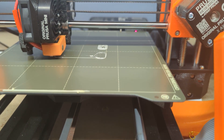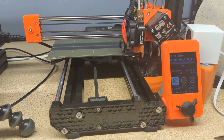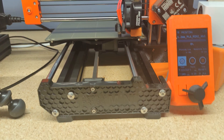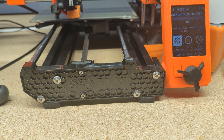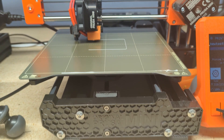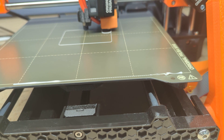Unfortunately I'm going to have to stop this and redo. Temp number two — we tried at 185 and it seemed a little too cool to get things flowing out the nozzle correctly. We're going to give it a shot right in the middle of the sticker recommendation at 215. This is looking much better. I can see in the before that things were looking a little thin — we just couldn't extrude quite as well.